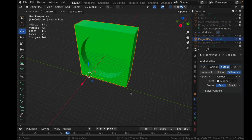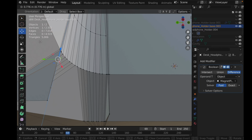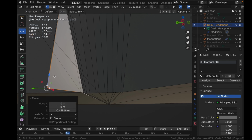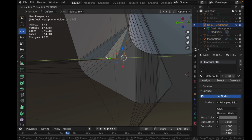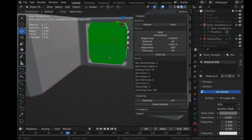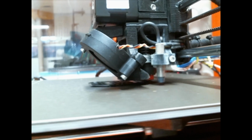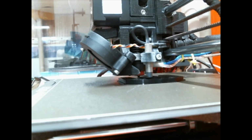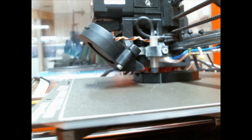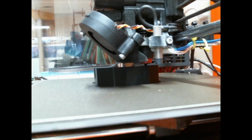I created the magnetic holder just a bit thinner than the cavity on two of the sides so that I could easily take the holder in and out if I messed up the polarity again, which I knew was going to happen even though I had marked the magnets. The magnet holder can accommodate either 1 or 2 magnets. Obviously 1 will have a weaker magnetic field than 2, but it worked for most of my lighter use cases. Having 2 magnets in there makes the bond much stronger.